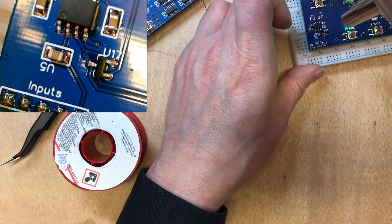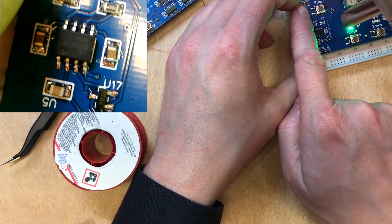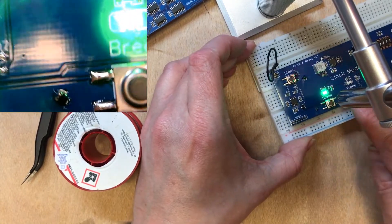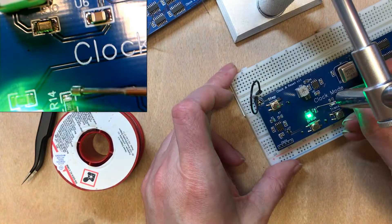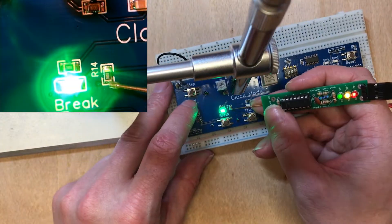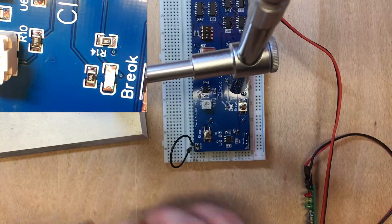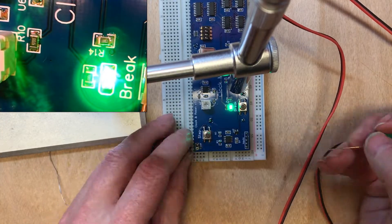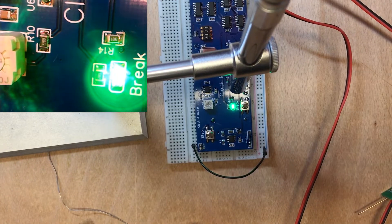The state being pulled back into brake constantly is clearly at least a problem here. I'm slightly suspicious of this MOSFET, because that's what that does if we fire the brake line or select down to ground, which is the same as pushing this button. Now there's a pull-up on the input here — the top of this resistor should be 5 volts, but the bottom of it appears to be floating.